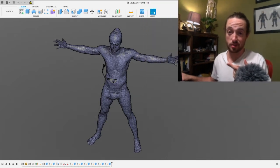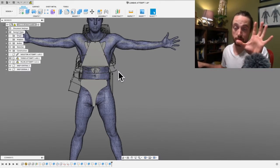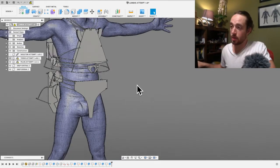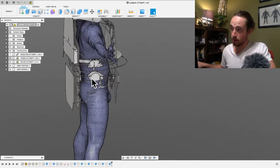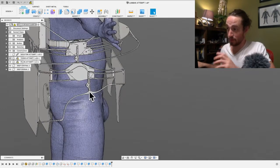Now that I finished this today, I'm going to go upstairs and do some more work on my exoskeleton. Here it is — this is the lumbar. I'll turn on these two parts so you can see them. This is everything I've built so far on draft five. I've done the torso, which I'm probably going to rebuild at the end after I've built everything else. I've finished the lumbar and I'm really happy with it — not planning on redoing that. All these gaps in here will be covered with sheet metal that's half the thickness — one-eighth inch pieces, so one-sixteenth — that I'm going to cold forge and then weld on.